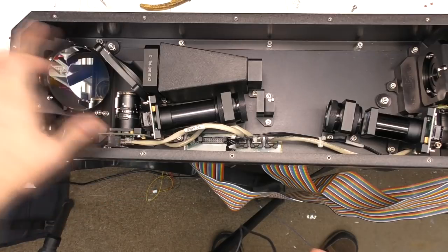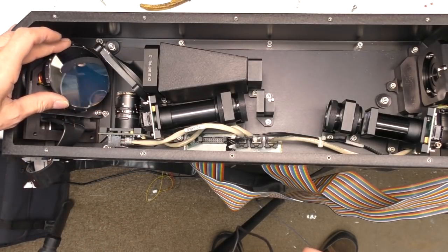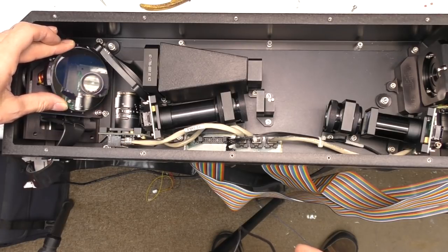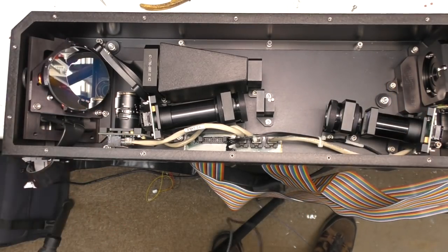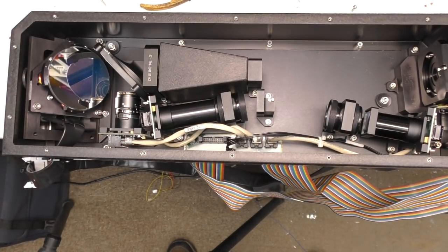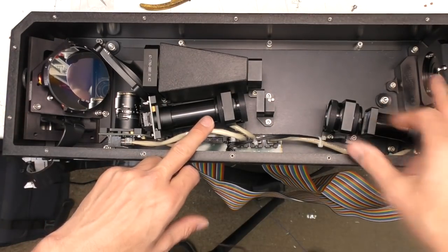There's a camera and a beam splitter here, so I think this is taking a fairly wide angle of view to find where the face is in the image, and then it can point this mirror to get that centered, and then use a much narrower field of view to capture the actual iris image in high resolution, because you need quite high resolution images, probably focused, to get accurate iris recognition. But there's also an interesting optical system here.